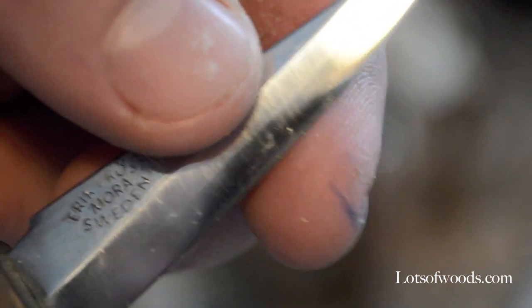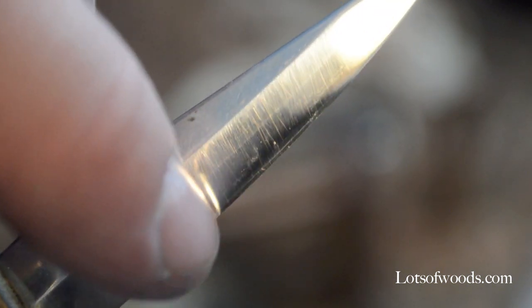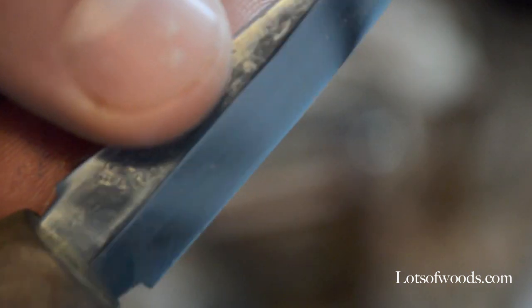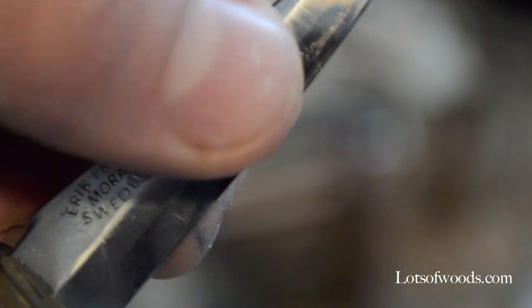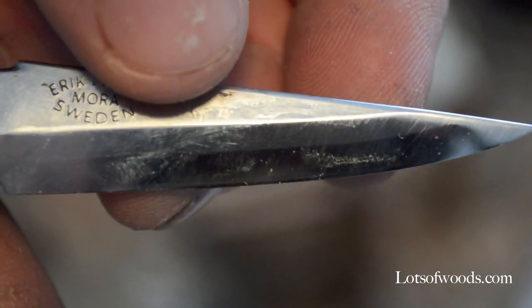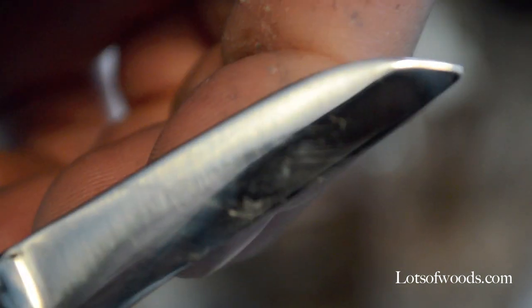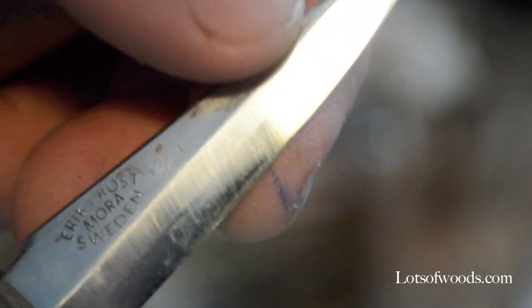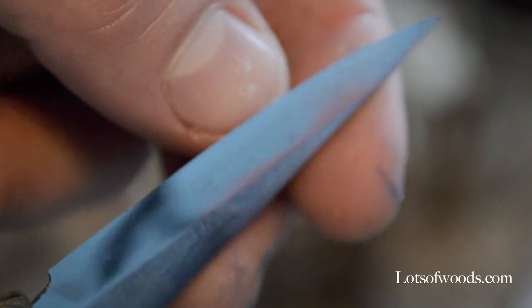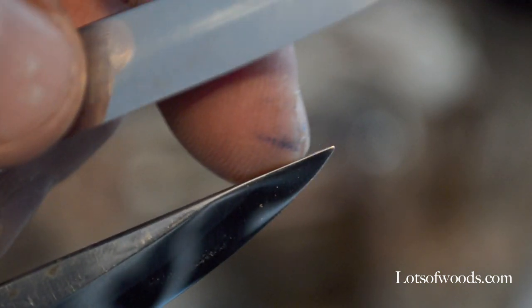The Mora does have a high carbon steel edge, but it's laminated — you can actually see the two-tone right there. You've got a milder steel on the outside and a high carbon steel on the inside. That means when you're sharpening the whole bevel, you've got half milder steel, which makes sharpening easier. They also say it's shock resistant. I can't remember the exact model, but I've been very happy with it. It holds an edge very well and makes sharpening easier. As a newbie, when I bought the Deepwood knife, there was no bevel and I had a hard time following it. With the Mora, you can just lay it flat on the stone and it doesn't take much skill. I should have got this knife first. I really like the point — this other knife doesn't really have a point — and with this point I can get into some good tight details, like the inside of the spoon bowl and getting from the bowl to the handle. The point gives you the ability to create a nice tight radius.